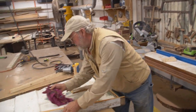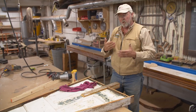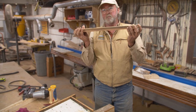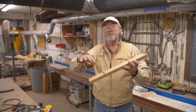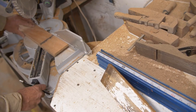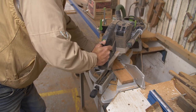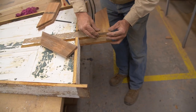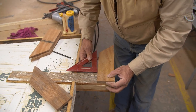I'll wipe a little bit of that extra glue off. I've got one last thing to do — unless you stick it in a pot it's not going to stand up, so I'm going to do four little legs that go in opposite directions on either side so you can just set it down and walk away. I need four pieces — I've got two identical pieces — and all I'm going to do is run a 45° cut through the center; that's going to give me four identical pieces with a little 45° taper on the end because you don't want it to trip on. I'll put a 45° on my miter saw and get that center right on the blade. Since this is flush, all I'm going to do is line it up on the corner and on the bottom — that'll get me a good right angle. Put a little glue on it.